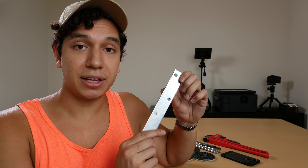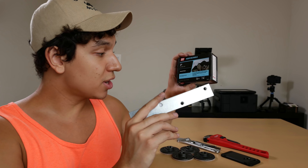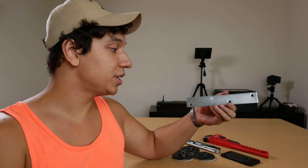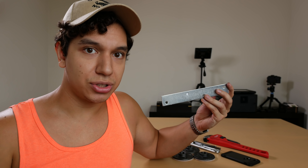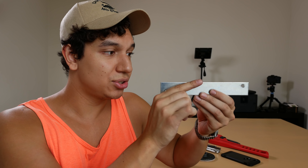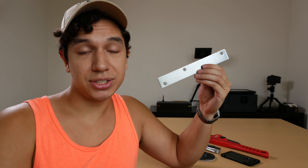The next solution I worked out was for these mending plates. These are to accent the corners of our table — two per corner, eight in total — giving it a nice industrial look, although not child-safe. Initially I was going to use those wood screws we purchased, but screws tend to work objects loose over time. I felt I'd get a more exact fit with nails. Our roofing nails have the largest diameter head you can find practically speaking at Home Depot. I bought two-inch long nails to make certain these stay put when placed on the edges of our table.